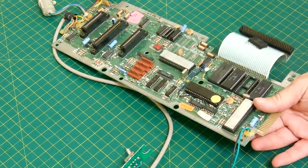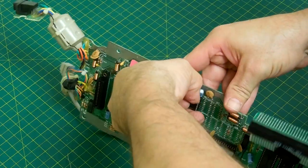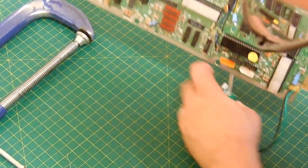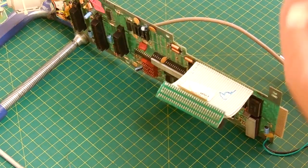Here's a socket where the pin didn't go all the way through. So as I said, I put it in the vise, put my fingernail on the pin that didn't go through — the little edge that's sticking up, the contact — and then heat up the other side and just push it through until it seats.